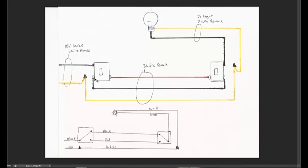The two wires that go on those bronze screws are called your travelers. Let's not get tripped up with colors, because just because I use these colors doesn't mean somebody else is going to use these colors. If you see conductors on the light-colored screws on the switch, then you know those are the colors they're using for their travelers. It doesn't have to be the colors you see here, nor does it have to be wired exactly this way — there are several ways to wire a three-way switch loop.